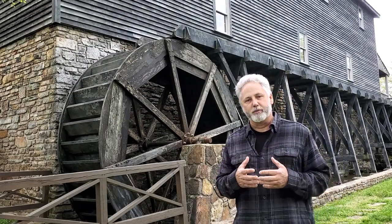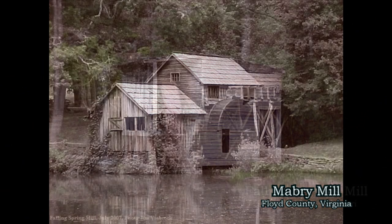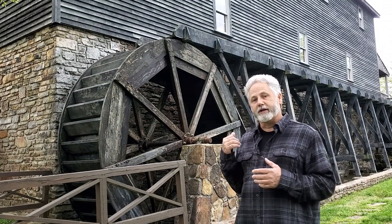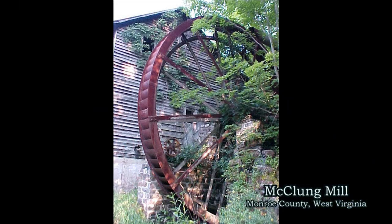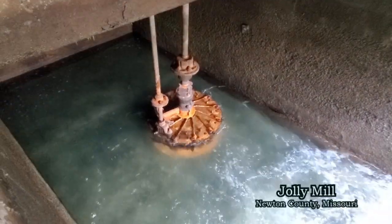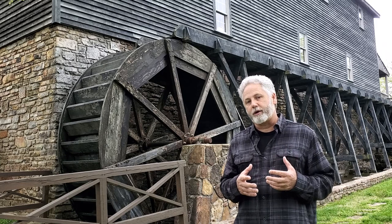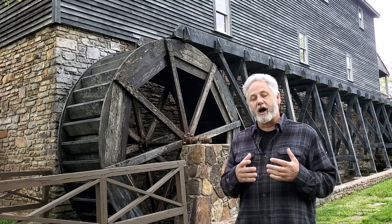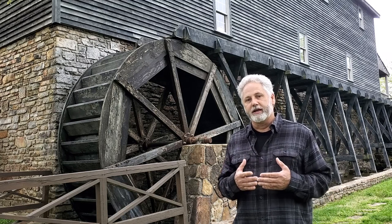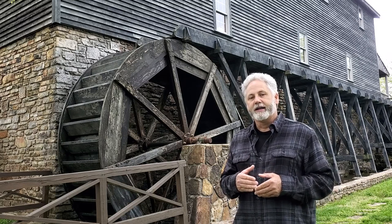Let's talk about how the mill is powered. This beautiful mill has a 12-foot overshot wheel. In my opinion, this is what most mill enthusiasts are wanting to see — they love to see the large overshot wheels. There are other types: you can have the water go on the back side, called a pitchback wheel, or the water can go under the wheel in reverse motion, called an undershot wheel. There's also a large cast iron piece called a turbine, found either beside or under the mill. All of these are valid ways of operating the mill and provide horsepower. Topography ultimately may decide what kind of wheel or turbine you have — they are the lifeblood of the mill, the electric motor, so to speak.